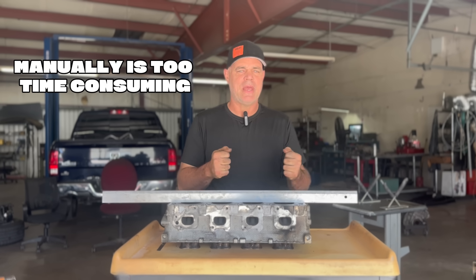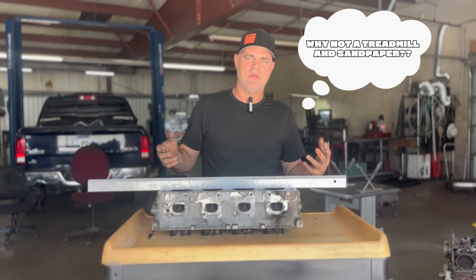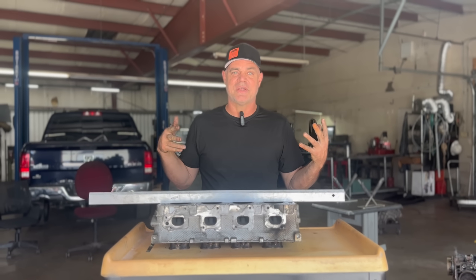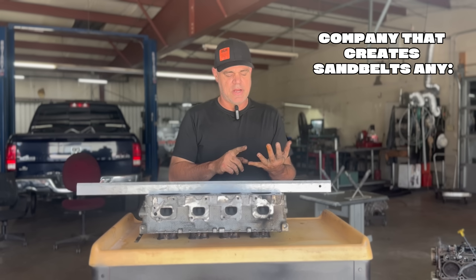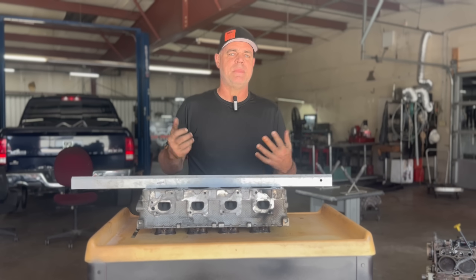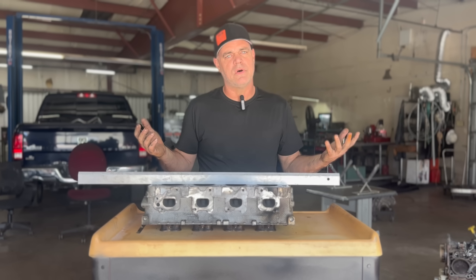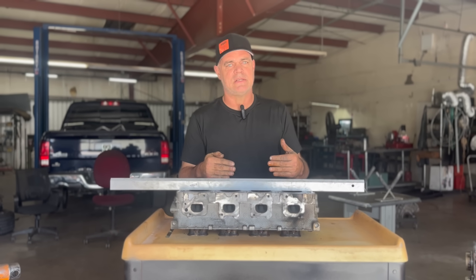For what I do, we handle a lot of heads — there's no way to do it manually, it would take forever, and sometimes these heads get really warped. So I thought: why couldn't you just put sandpaper on a treadmill and let it do the work? I just gave it a shot. I found a treadmill on Craigslist or Facebook, cut the belt off and had a perfect measurement of what I needed, then found a company that creates sanding belts in any length, any grit, any width. About three weeks later I got the belts in, matched them to the treadmill, and my very first version worked great.